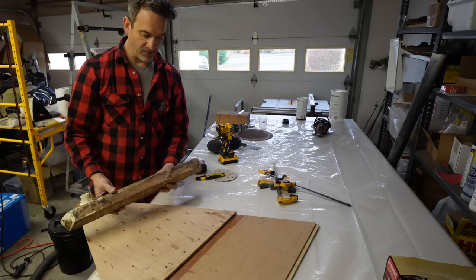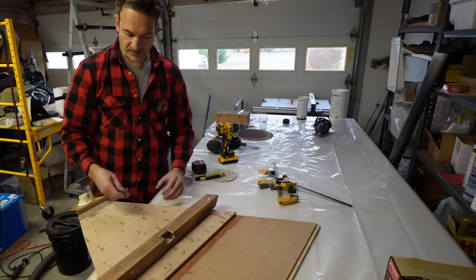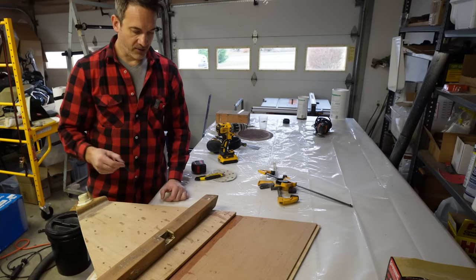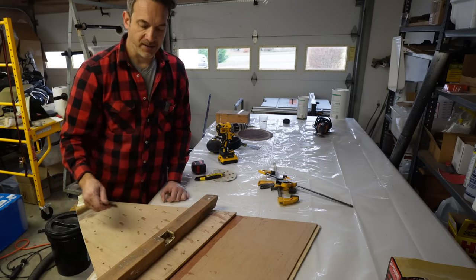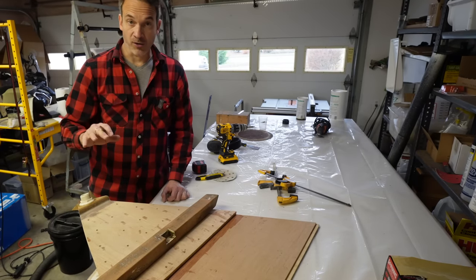It'll help it sit a little more flat, and then we'll locate it on the bulkhead here, make sure it fits, test it out, and then I'm going to actually through bolt it. We'll epoxy plug those in the plywood just so that this thing on the anchor side at least is totally waterproof.